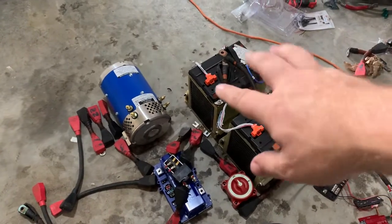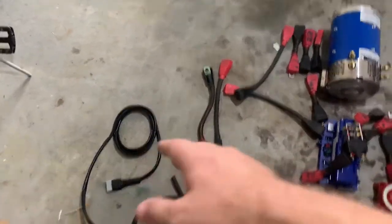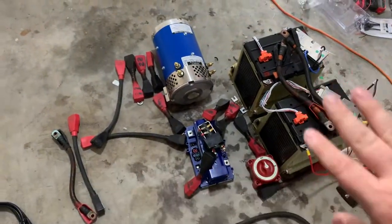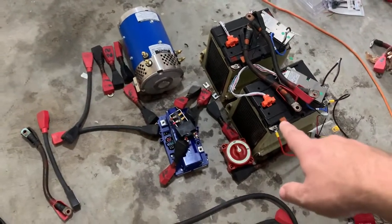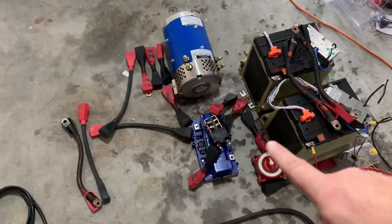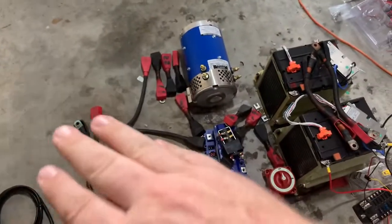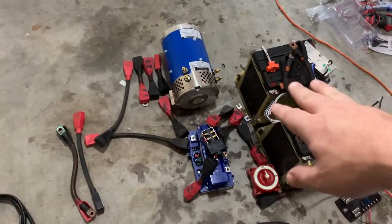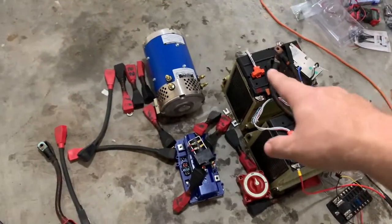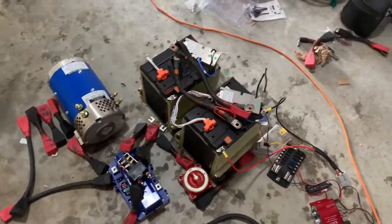I have some cables laying across the top because these are both 48 volts — I'm going to be connecting those in parallel. There are two more batteries to connect in parallel, and I need to run two cables across for the positive and negative. Main positive comes off on this side, main negative on this side. When setting up parallel, you want the path from your main points to have the same resistance no matter which battery you use. I could have had both positive and negative over here for wire management convenience, but that would mean one battery has the lowest resistance because wire length counts as resistance.